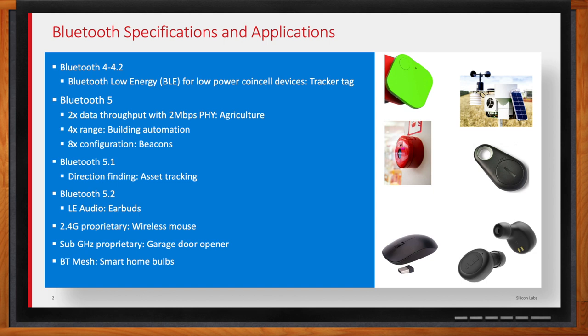BT Mesh is surely a very exciting update. The big application is smart home light bulbs. All the mesh protocols out there today have one big limitation: accessibility — they're all kind of a closed system to the user. If you install light bulbs on a popular mesh protocol, it has to go through a gateway to transform to the cloud or to Bluetooth. BT Mesh is trying to solve that by bringing accessibility into the mesh world, and we're seeing a lot of light bulb customers trying to get this going because of that huge advantage.